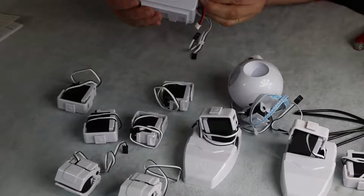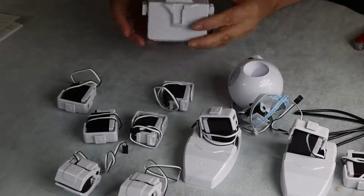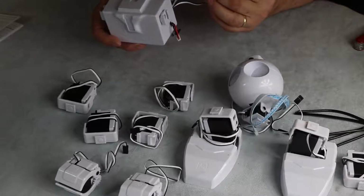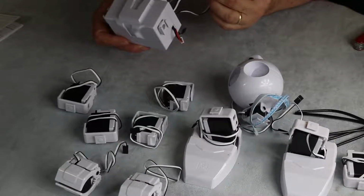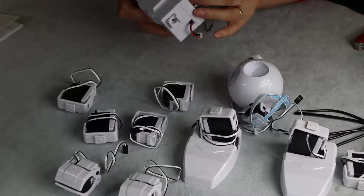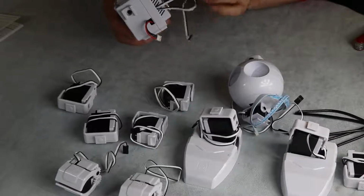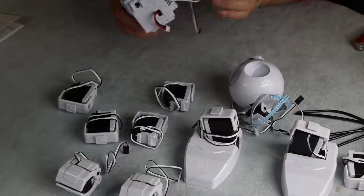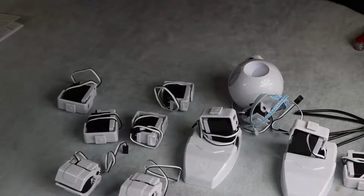Now what you'll notice on here is you have a couple of pieces on the side. These are actually connected to servos inside the case, and these cables are for those servos. They're labeled left and right, and it says we need to connect the left shoulder servo, which is this one, to port D2. This is port D2, so we connect that like that. Then it says connect the right, sorry, it doesn't say D2, it says D3, so we'll disconnect that and connect it onto D3. The right hand connector should go on to D2. So we now have his shoulders connected.